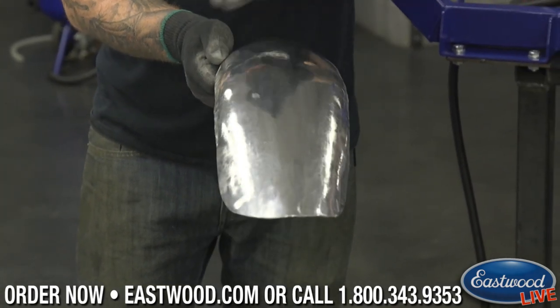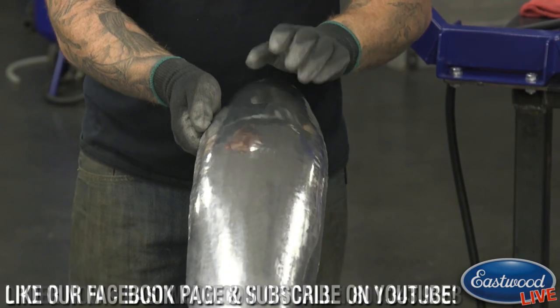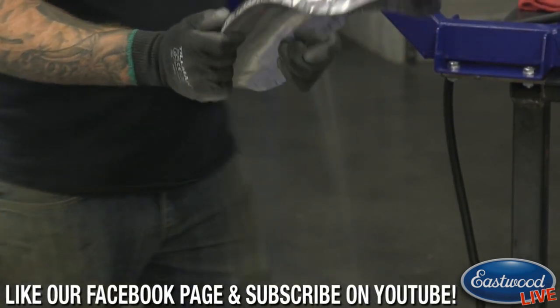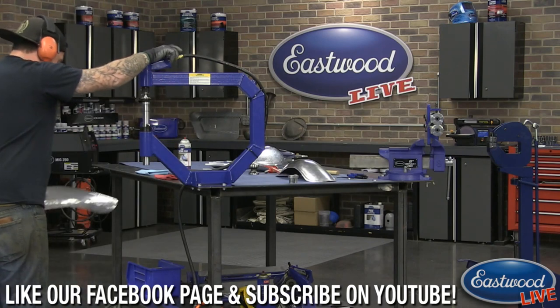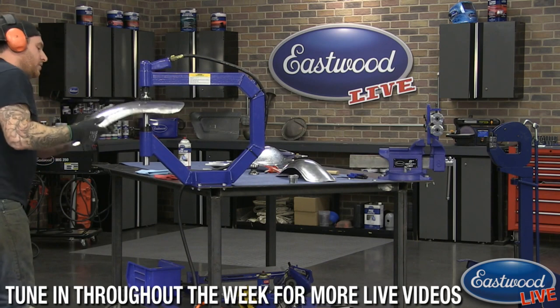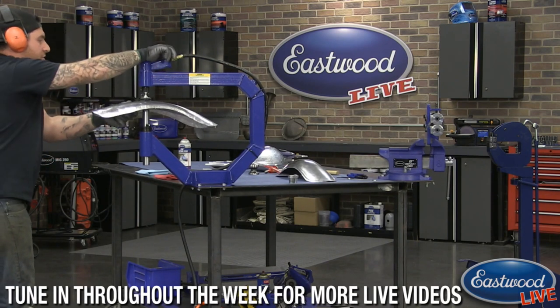just a little bit. So when I'm saying crown, I mean the side to side like this. I want a little more in the center here because it's kind of sharp here and it flattens out and then gets sharp again. So what I could do is turn this up a little bit and I could put it just in that area there where I want it to be, and turn it up and stretch it a little bit.